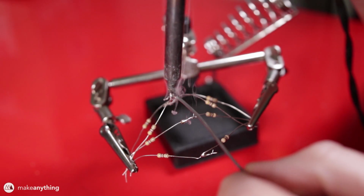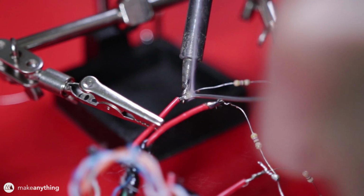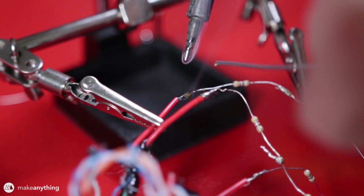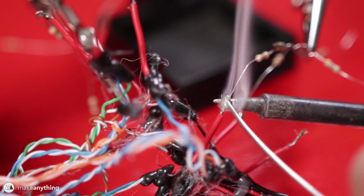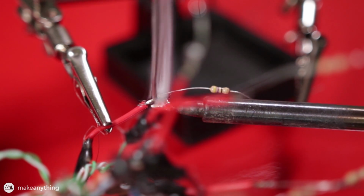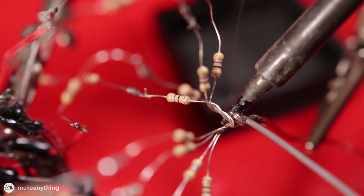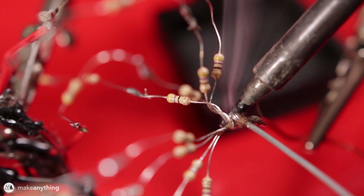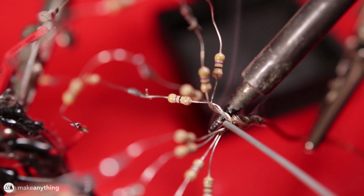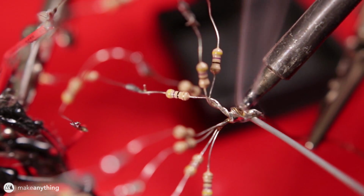I could have just bought a 100 ohm resistor, but I just connected the ones I had, two 47 ohm resistors, and combined those create just about enough resistance. I'm honestly not an expert with electronics, and I didn't have the data sheet for these LEDs, so I didn't know exactly how much current they needed. But I followed the advice of the Ask Engineering subreddit on reddit.com, and they told me to put resistors in front of each series circuit.